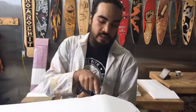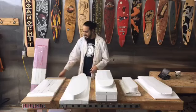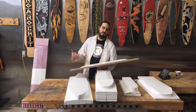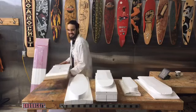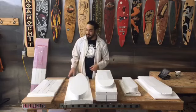Were you to cut out that little flat space, that little termination point, your veneer would kink in the corners, it would make corners, it might not laminate, you would have delam, lots of things may happen. That being said, I have seen some guys out there who have done this thing called cereal bowl concave, and that's pretty cool. It's where they can make a drop deck where they don't terminate the flat space. And it's called cereal bowl because they poured milk and cereal in it and ate from it to prove that they did do the bowl bend. It's a very advanced technique of bending veneer, but if you look out on the internet, I'm sure you'll find maybe not instructions, but inspiration to tackle something like that.